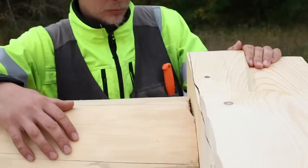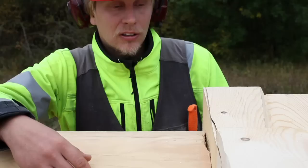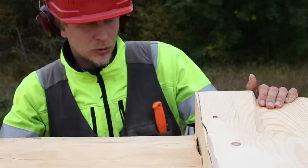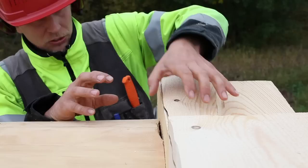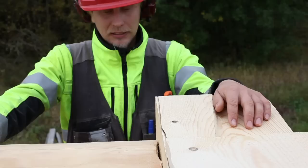Maybe after two years in heated conditions, the outer and inner edges of the groove will reach a different level of shrinkage and thus even out. This 1.5 mm difference in the groove will disappear after two years of drying. The edges in the notch will bite into the crossing log because of compression, and later when the crossing wood shrinks, it will bounce back a little, like gum — but just a little, so it will end up quite like it is now.